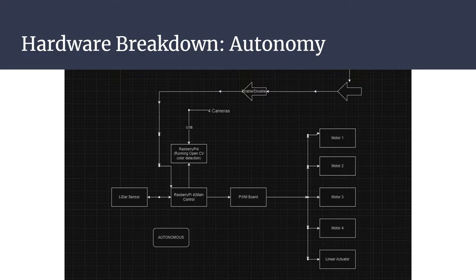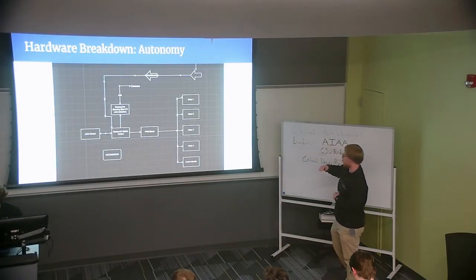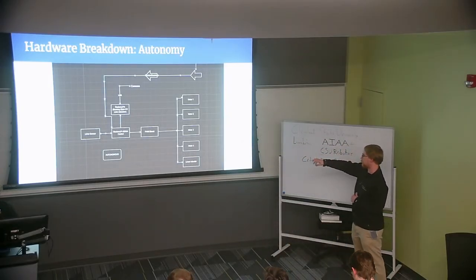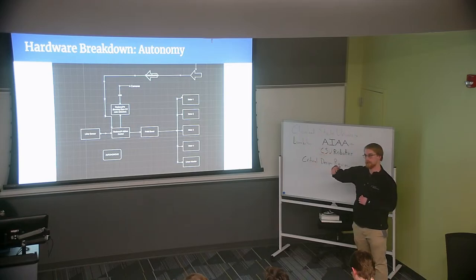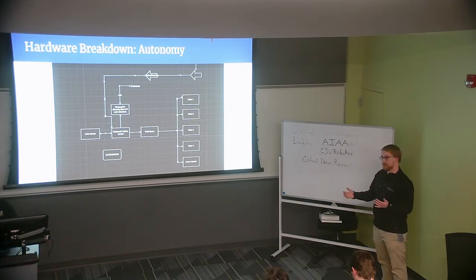Raspberry Pi, so the main controller, to a Raspberry Pi that will handle the image processing. So you can think of this as your primary controller, and then your secondary controllers are connected to it, which is in turn controlling the rest of the system. So the motors, which includes the drive, the raising and lowering, the digging, right? And that's all interfacing with the computer side and the software side.